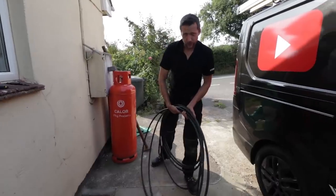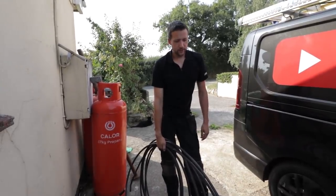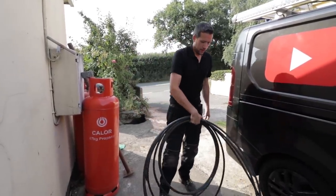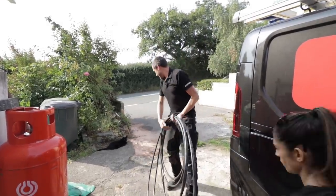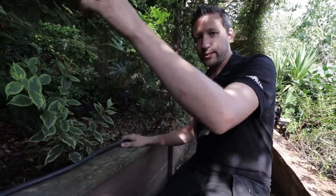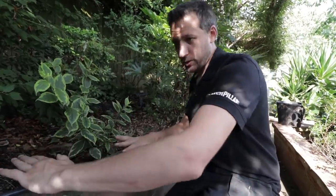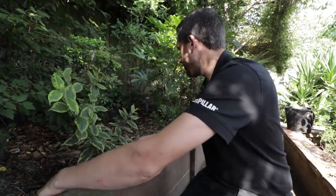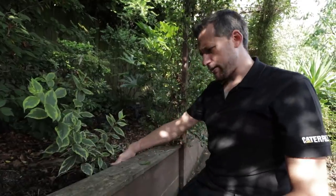We've got 60 metres from City's of 10 mil three-core - it's amazing how expensive cable is. This run here, 60 metres, nearly 300 quid from City's just for this. I get a good price from City's but my customers are like 'oh it costs that much?' - yeah it does, it's expensive. So what we're going to do - the customer's put these railway sleepers in with capping over the top, so we're going to tuck this underneath and cleat it in behind here, just so it's out the way. Rather than digging down 60 metres of garden, we're just going to cleat it behind here where it's pretty protected.